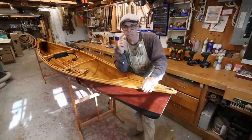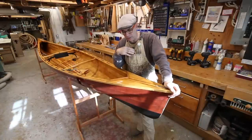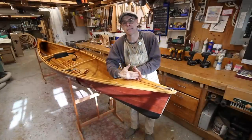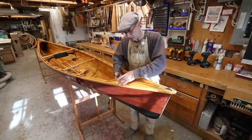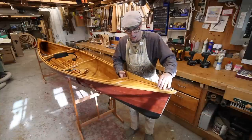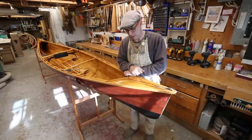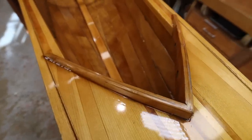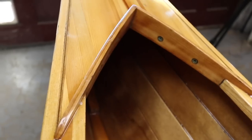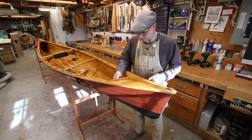One of the things I did was laminate up the decks — I was just working with smaller pieces of stock on hand. Nowadays I like to keep things simple and would orient the grain differently. The decks are mostly white cedar with a little bit of cherry sandwiched in there, and there are a lot of lines from these laminations, which at the time I thought was cool but isn't really to my taste anymore. I've got these little coamings which I still think were a nice detail — I made them in two pieces, one laminated to the inside and the other slapping down on top of the deck to clean up the deck joint.